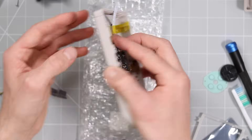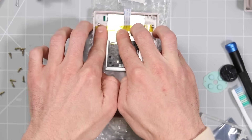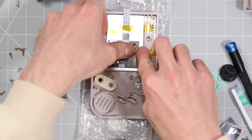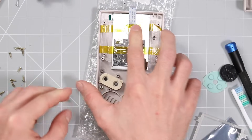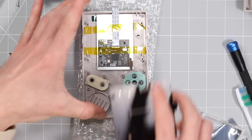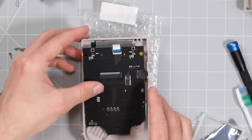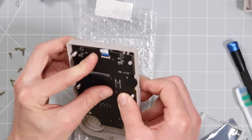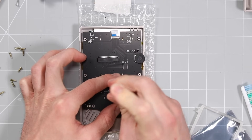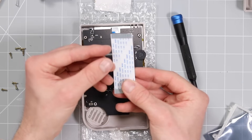I'll just make sure that the screen is centered at least where I think it needs to go, and I'll stick it down so the screen is nice and secure. I obviously know that's not as secure as it needs to be, but it's going to help just test the alignment. The D-pad and start and select buttons have fallen out so let's shove all those back in. Now we can take this and connect up the ribbon cable. We need to solder in the speaker, but we're going to do that in just a second. First I want to check that the screen is aligned, because then I'll probably just put a couple of dollops of hot glue either side.